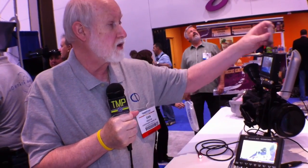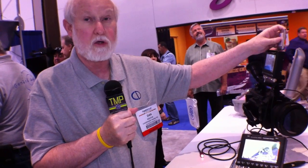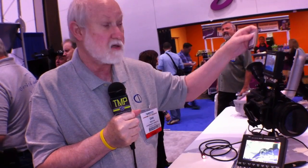You have the option — let's say you're recording from an F3, F35, or other professional camera that has Sony S-Log. You can record to one SSD with native S-Log, and record to another where we take the native S-Log but burn a LUT into it, recording it with a burned-in LUT to make it easy for post. So you could do two simultaneous records — both full uncompressed — with native S-Log, no S-Log at all, or with burned-in LUTs.